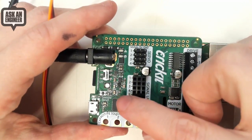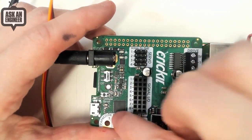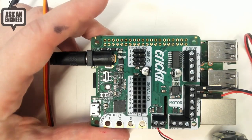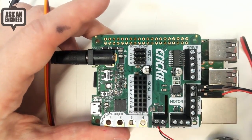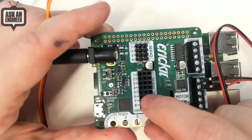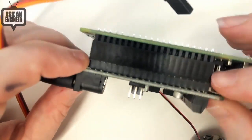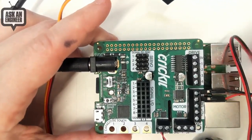These are the signal IO headers — you get eight pins and each pin comes with a matching power and ground, which is why there are three in a row. These come from the microcontroller, and you control them over Python. You can do analog inputs, which you don't have on a Raspberry Pi natively. If you have analog sensors to connect, you can plug them in here — like a potentiometer or distance sensors with analog output. The Pi headers look like they can take stackers through them, and you can stack through them, though right now it has a basic non-stacking header.